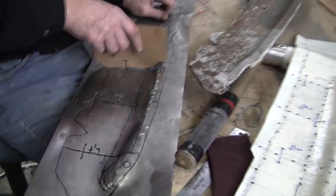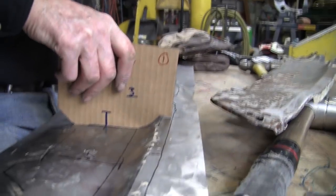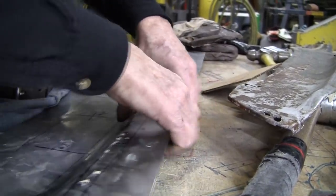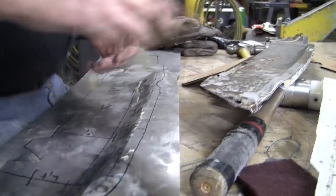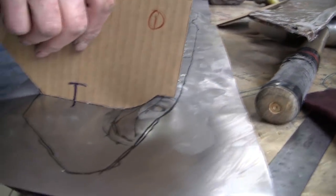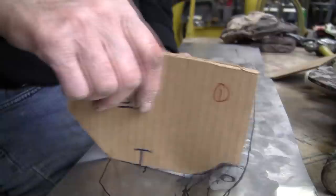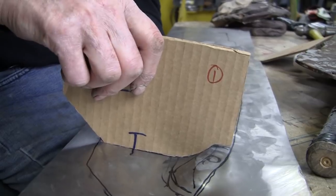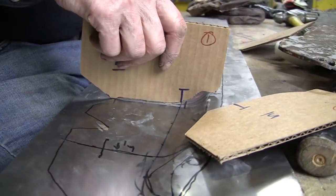So let's see how that did. It looks like it needs to come up still a little bit more, but that could just be bending up here like this. Let's get five. It's all about the same. See, these are our little index marks. We index that on there because if you don't have the index mark, you can get a different value reading all the time. So you've got to get that index just right.